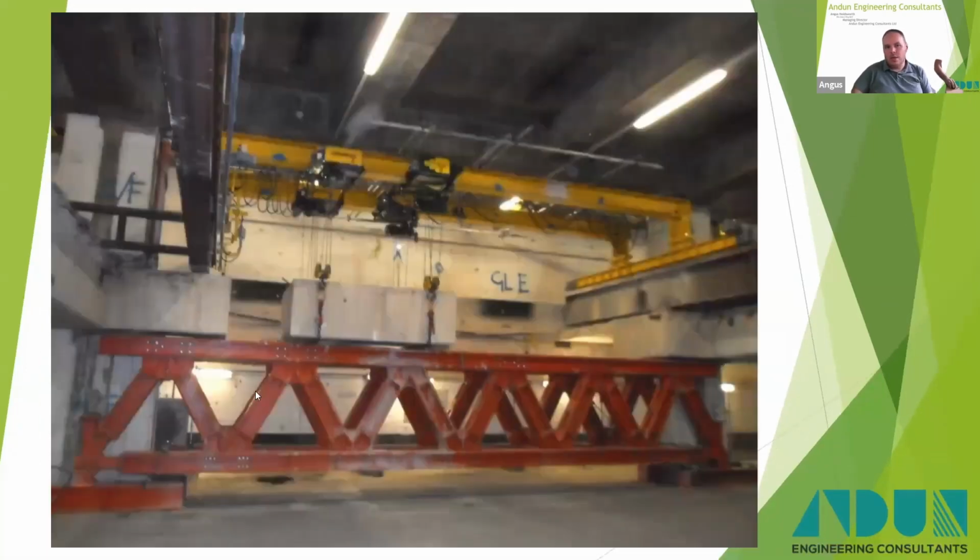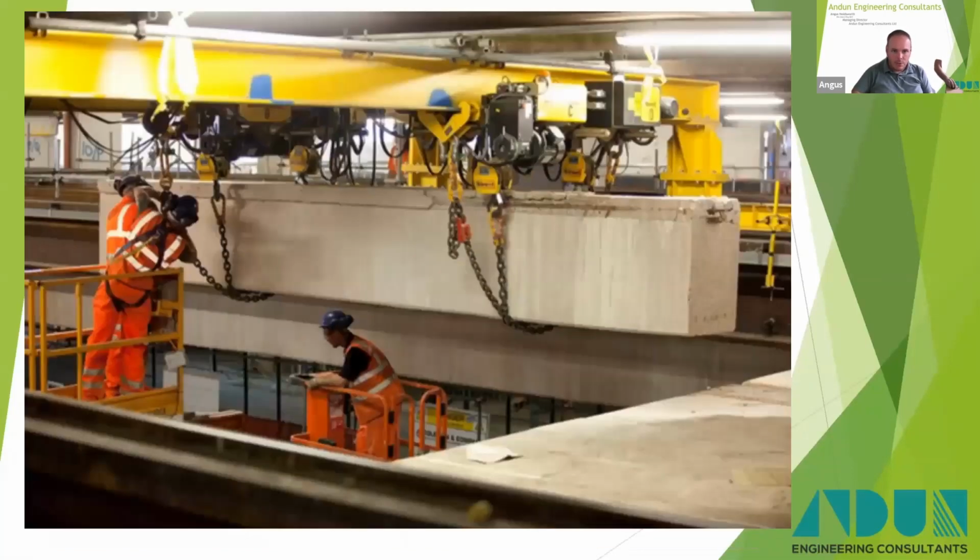And there's just another nice little elevation of the crane in action. So you see they're quite a low headroom. That all had to be quite well thought out to make sure the correct hoists and things were selected for the low headroom, make sure we could actually lift the slabs out as we required. You see there a nice 10-ton lump of concrete slung. You can see how tight everything is, pulled all the way back up with the hoist block basically touching the hoist itself.